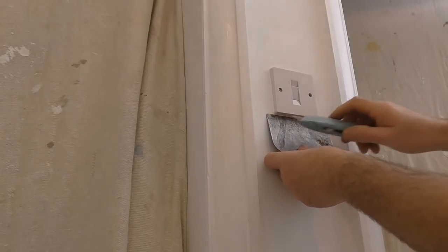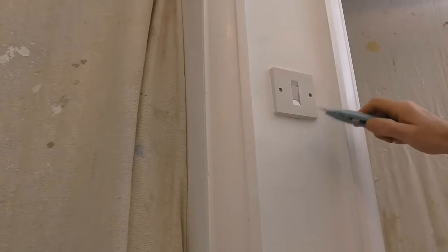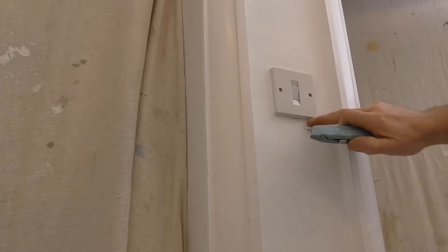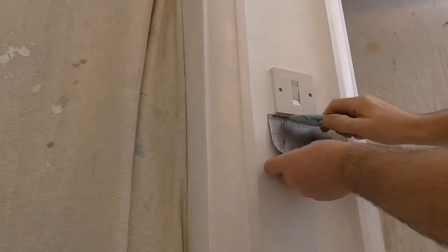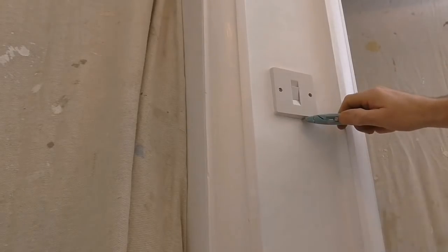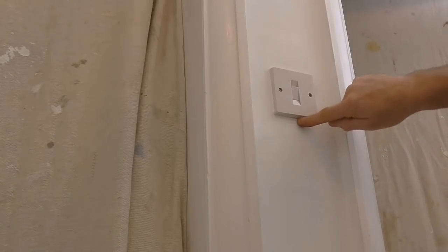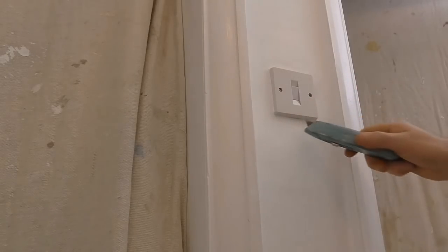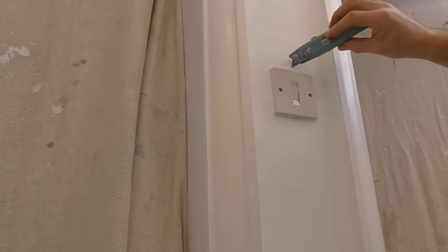Either way, trimming the paper, you're going to expose the backing, which over time will turn yellow. Also, if this plasterwork is not very good near the edge of the backing plate, then when you're cutting, it can punch through. So then when your paper dries, that will dry back, it'll shrink to it, so you'll be able to see round where the divots, where the holes are.